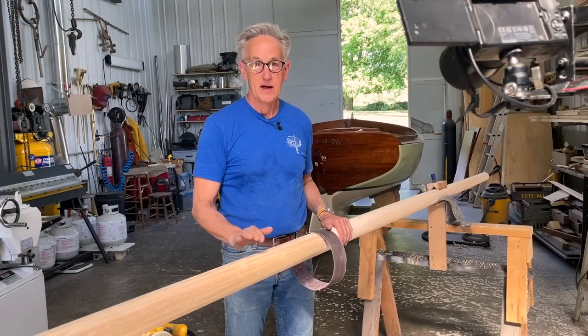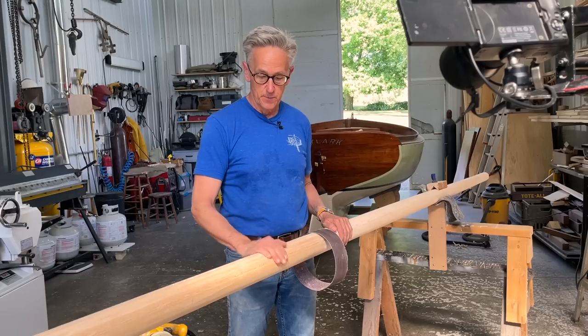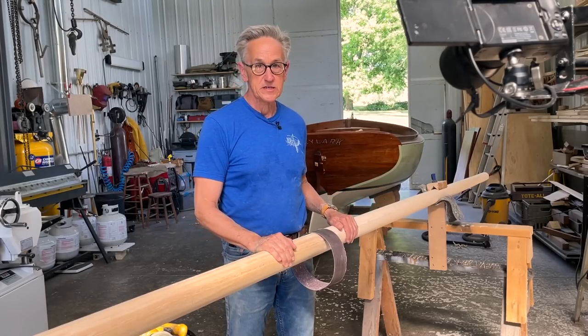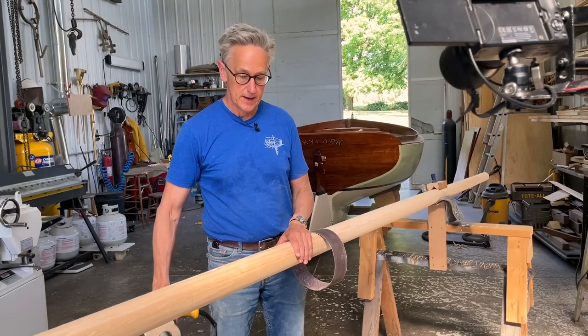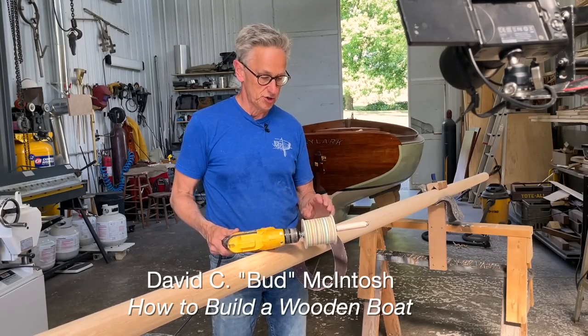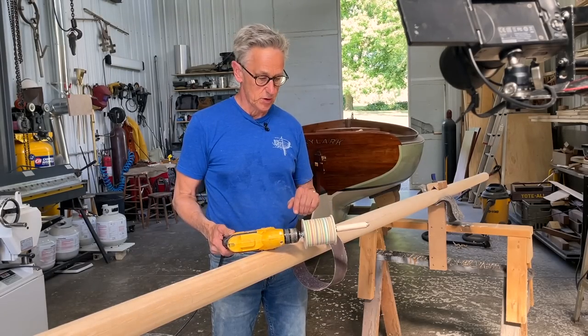Now that I have the mast down to 32 sides, the next thing is to sand it perfectly round. And you can see on this, the upper end, I've already sanded it, and I've done that by using a device that was developed by David C. McIntosh, known as Bud McIntosh. He wrote a book, Building Wooden Boats, and I'll leave a link in the description.